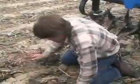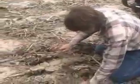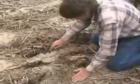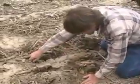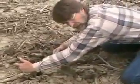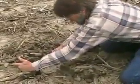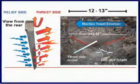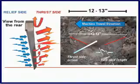You can see here another hole. Here is the entry of the tine. The machine was headed in this direction. This is the entry right here. This is the exit over here. You have the very characteristic long engagement of the tine, and this is a function of the shaft speed and therefore the resulting length of time that the tine is actually inserted in the soil.